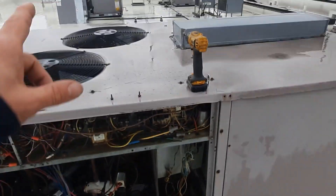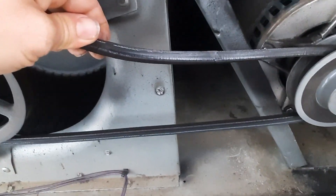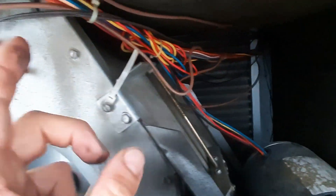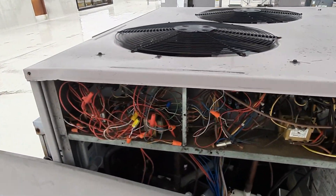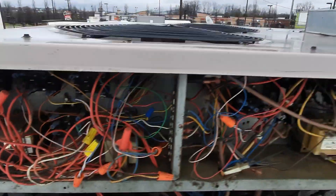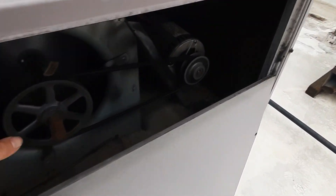The bad thing is it's probably going to run, and that guy's got a dead compressor - it's a newer unit. We need a new belt - you can see that belt's ate up. That's our recoil right there that was added. All the wires look - good lord, it's a wonder it didn't have a low voltage short before. Whatever happened here, wires are just hanging everywhere - it's like every other Carrier but this is a mess. It works, but let's hope we don't have to decipher any of this wiring. Let's go get a fuse, find this breaker, find a belt, at least get something running.